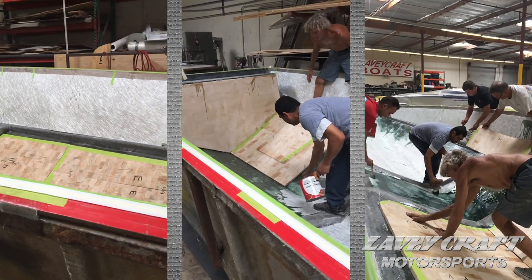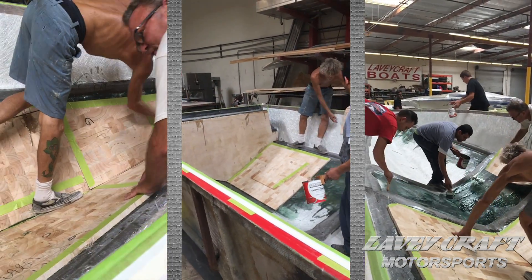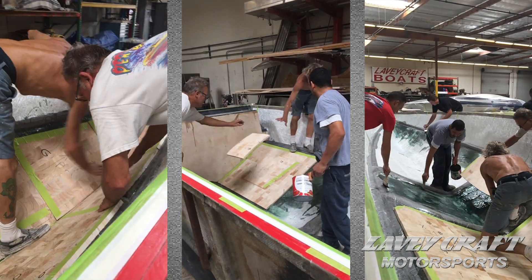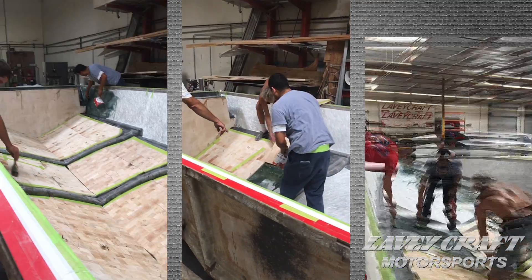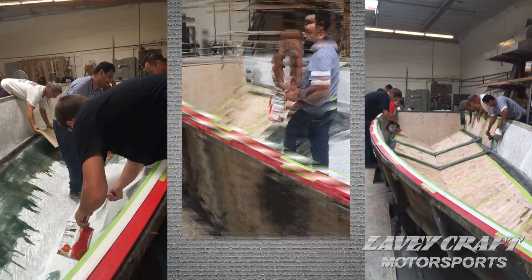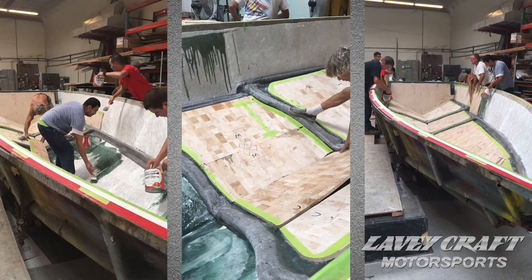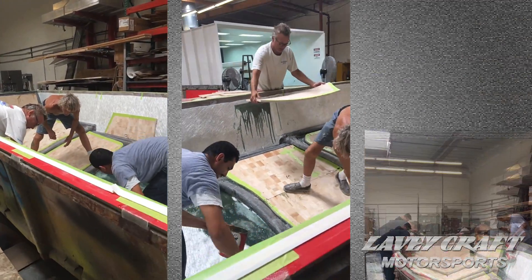When we utilize a bag process, we're actually extracting all voids with a plastic material, therefore utilizing equal pressure from tip to tail. When all this vacuum bag process is done, essentially the resin has migrated to bond the core and to migrate into the balsa, therefore creating a very rigid structural integrity throughout.